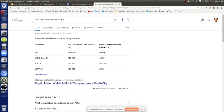That's perfectly fine. What you want to do is prevent frying the stuff like we are right now by going way above those points, which we clearly did. So here we want to stay within a few degrees for optimal melting. The less breakdown of the material you get, and breakdown means crud building up inside the actual filament maker.